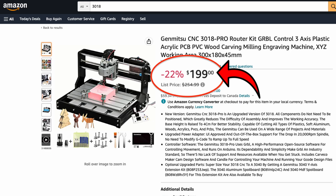When you start shopping for these, there's really two silos you can be in. The first is the low end range — we're talking about 3018 machines. They tend to run anywhere from $150 up to maybe $300, $400. If you do a little research, you'll discover those are not machines you want. They're actually really poor quality, the spindles are really underpowered, and they're just not great machines. So I would definitely not recommend the low end.